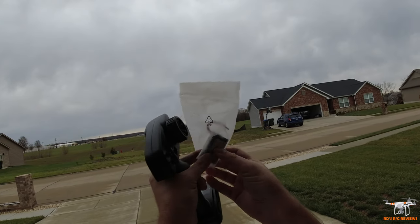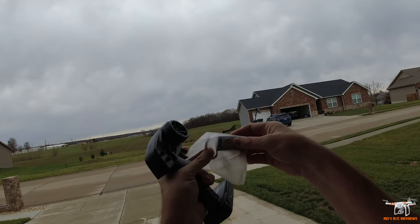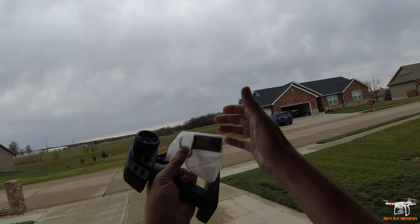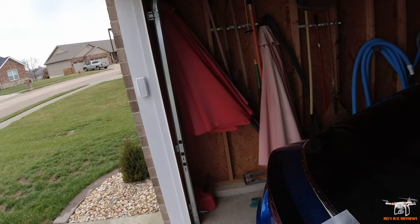That is a way they were able to get a small battery pack with higher capacity. But do keep in mind, since it's wired in parallel, there's no way to balance charge, so the batteries could over time get out of balance. But these ought to be cheap, and you can buy more if that would be the case.